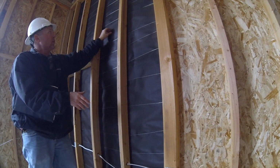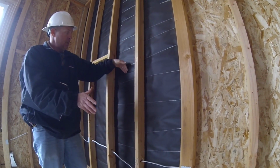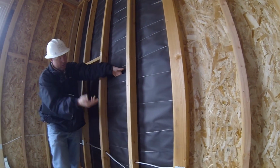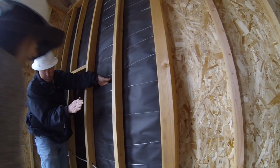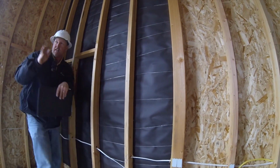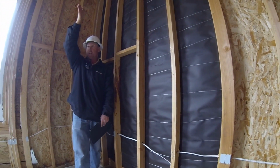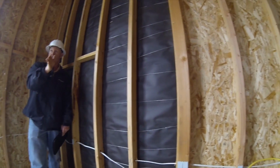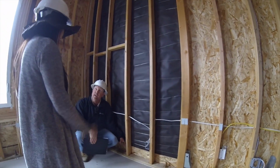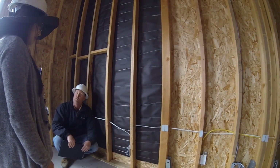But over time, water will start to bead up in here. And when water gets in right here, it's okay, because the reason it's lapped like this is that it catches the water and then pulls it back out. So the lap is the opposite down here. The water comes in and then it pulls the water out like this. In an exaggerated example, because we're talking millimeters here, the water comes in like this, and it keeps pulling the water out until it hits that screen I was showing you guys outside. Then that channels the water completely out. So that's how it works.